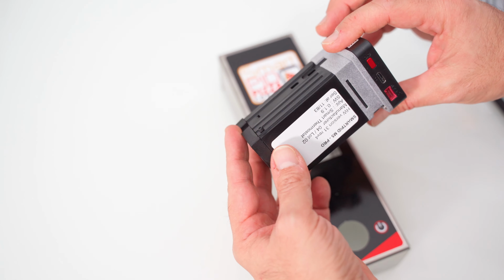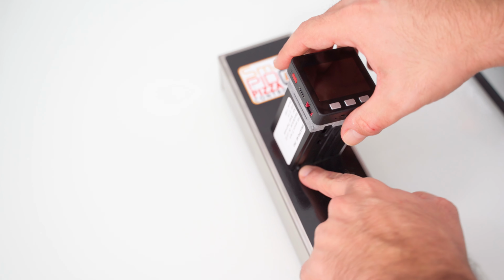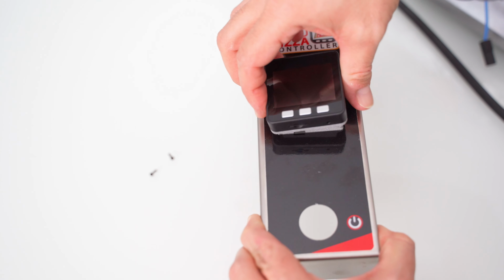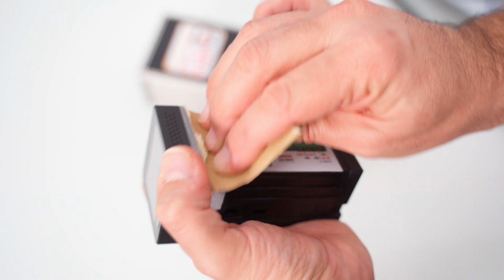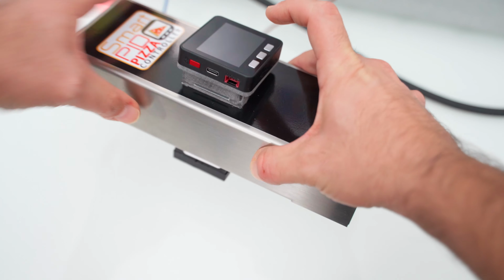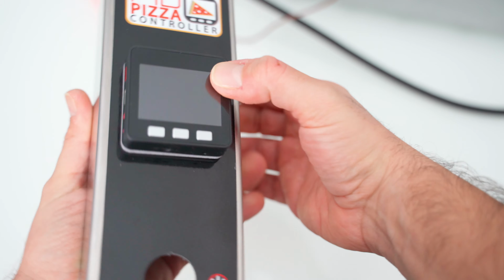As soon as we try to insert our Smartpid into the new faceplate, we see that we first have to remove the 2 rear screws provided. But even after removing them, unfortunately the PID is slightly wider than the opening of the DIN. I solved this issue by filing the right and left sides of the PID as well as the corners, initially with some sandpaper and then with a metal round file. After having filed it enough, it will fit just fine without any resistance.